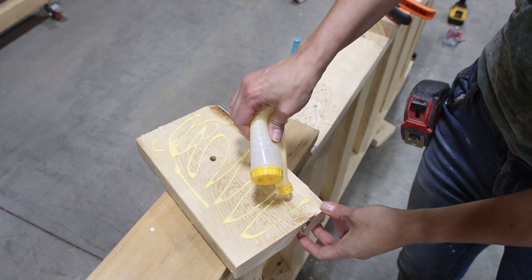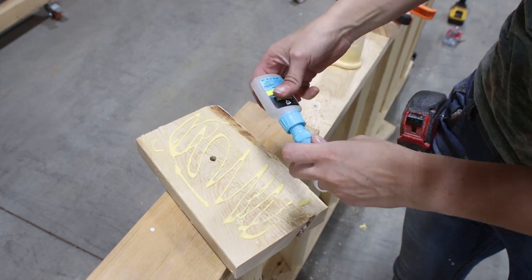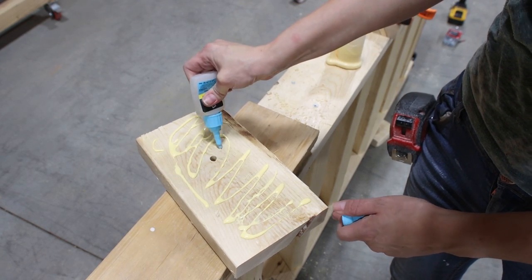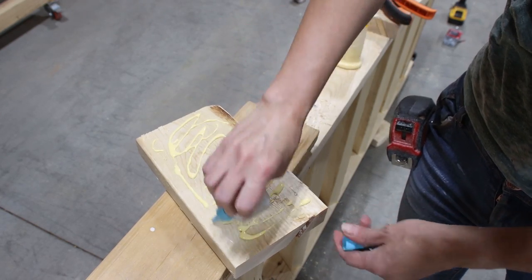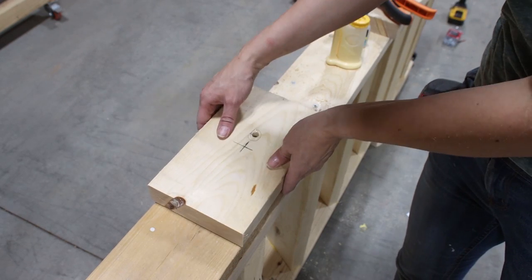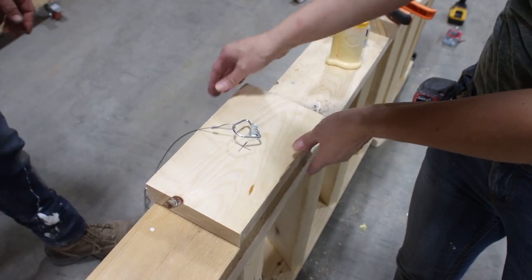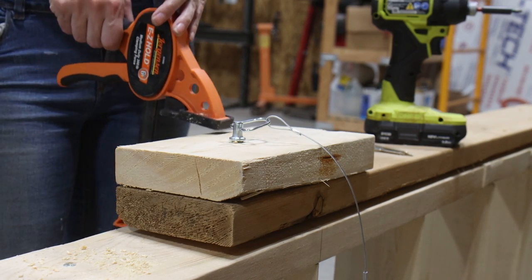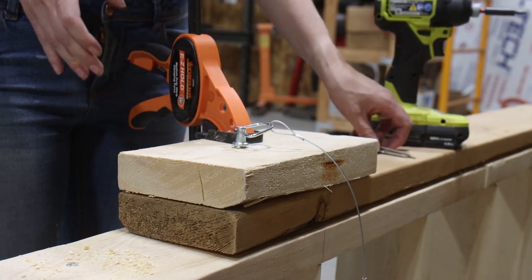If you're ever building in a hurry, a great tip is to use both wood glue and a quick drying CA adhesive like DAP RapidFuse. First, apply your Weld Wood Carpenter's glue to the surface like usual, and then follow up with a few drops of RapidFuse. The RapidFuse grabs the wood almost instantly and cures within 30 seconds — it basically works as an integrated clamp holding your pieces together while the wood glue has time to fully cure. I lined the spacer block back on top of the scab, making sure the three-eighths inch hitch pin hole was still aligned, clamped everything together, and secured the block in place using more two and a half inch screws.